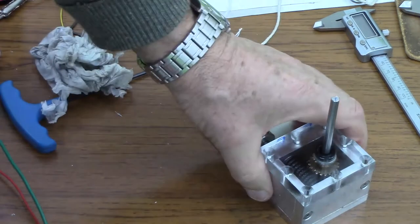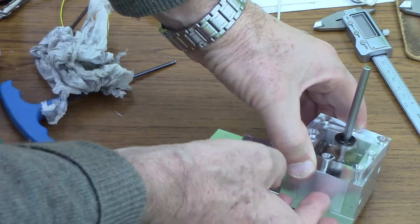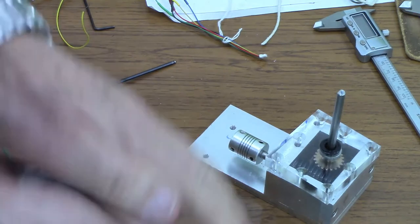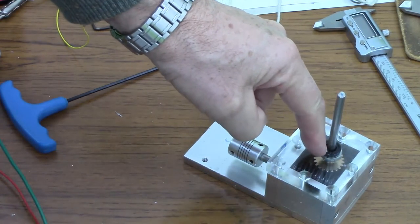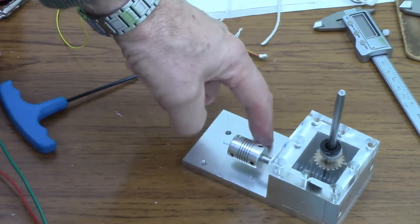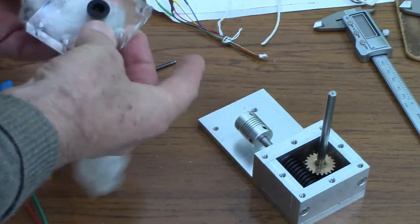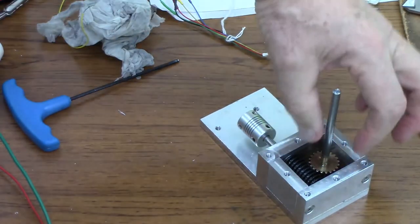And that causes me a problem because the bottom of this box is not thick enough to accommodate both a bearing and a seal. So my idea now is, see, there's no easy answer, there's no simple solution to this problem. My idea now is that I will fix a plate underneath this gear to this bottom, which will accommodate the bearing that at present is actually cut into the bottom. Then I can use that space to take the seal. That means that this gear will be higher up, which of course it can't be. So I'm hoping that I can actually put this gear the other way up,